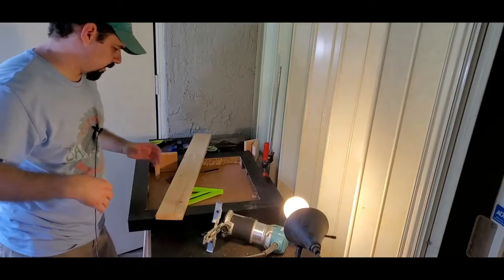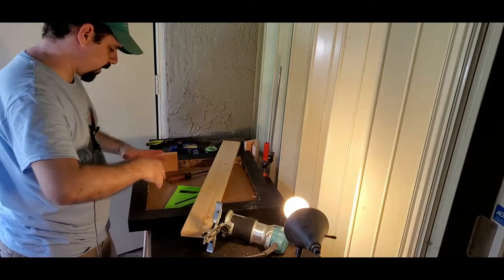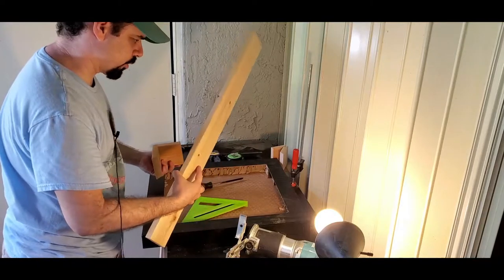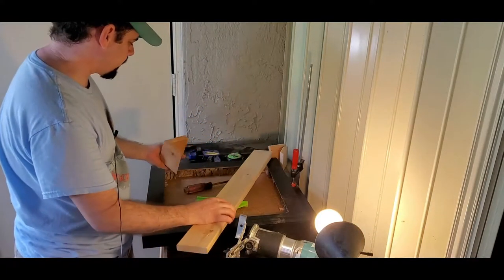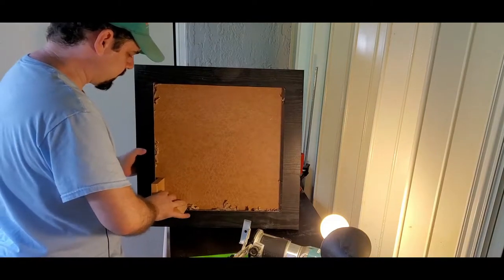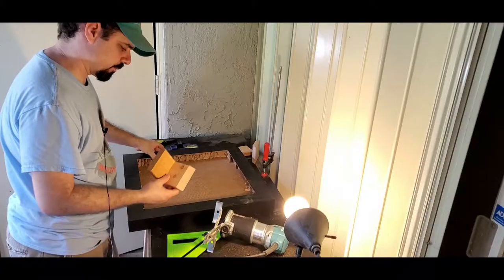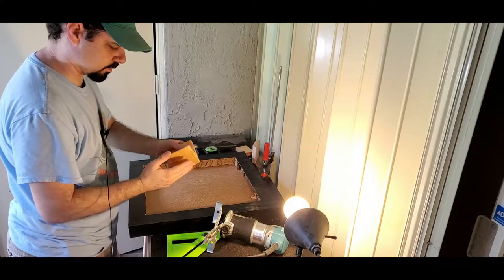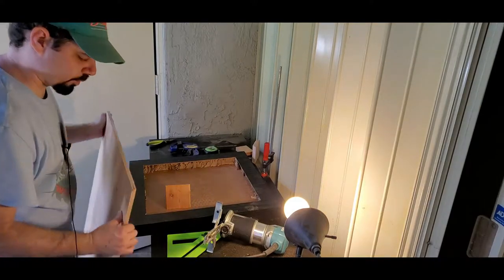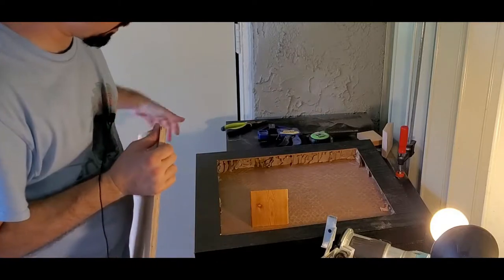All right guys, so I figured some of it out right now. So I'm gonna put a frame inside here. There's a little sample. I'm gonna use these pieces of board and cut miters and make a frame. So I'm gonna put a frame inside, be able to tack it in there. But also before I do that, I'm gonna put a rabbet on the back and then fit in a backboard using this material most likely. So that would lay in the back of the frame.